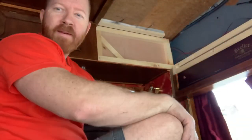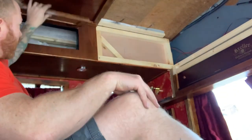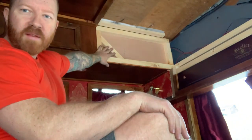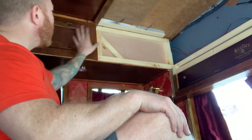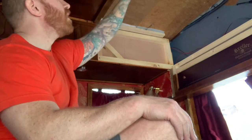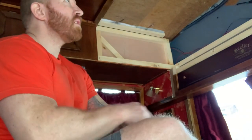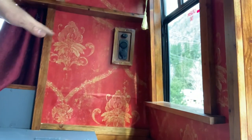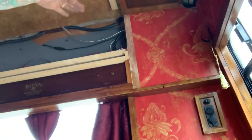Robert went into the store to get some groceries because we don't have anything up here. Now that we got the unit out of here, this is the other side of this cabinet. We can actually utilize the back space more easily by putting this on here, so I've got to modify this a little bit — just to duplicate this look and then we can retrim it. I have to put some furring strips up here and across there so that we have something to attach the false ceiling to, and then put the trim on. I may actually wire in another light in here possibly. I may have to move that switch up higher because now I can actually make my desk space here, which I was originally planning to do but couldn't because my head was hitting this thing.